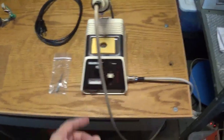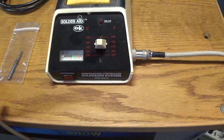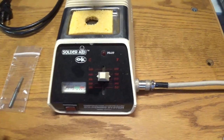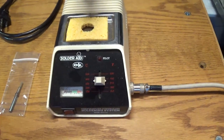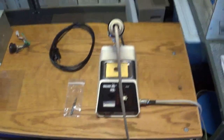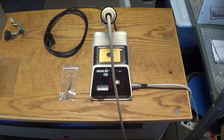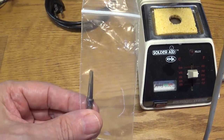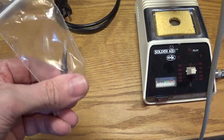The iron has an analog control and can go up to about 950 degrees Fahrenheit with a temperature meter. When you go past 700 degrees Fahrenheit, make sure you use high temperature tips — do not use your standard tip or you'll burn it up. If you do, that tip has lost its temper. The tip I'll be using for soldering on these caps is a 3.4 millimeter, because the power supply has large copper traces requiring more heat.